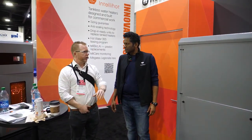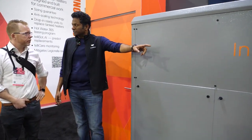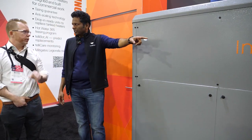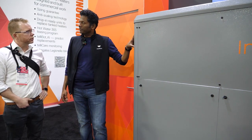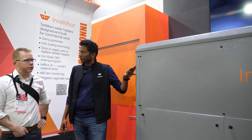What sort of capacity would this actually have from a BTU standpoint? This goes in combination with our IE6, our modular heat pump — that's the outdoor unit we see on the outside. This is designed to heat water on demand. You put one IE6 and two thermal batteries and that'll serve 80 to 100 room hotels or a 100-unit apartment complex.